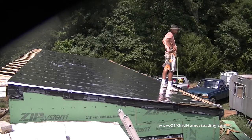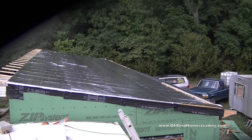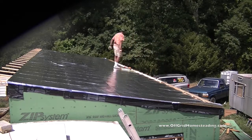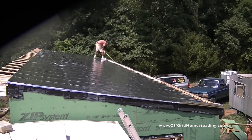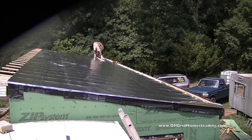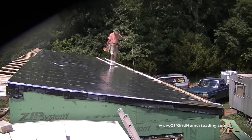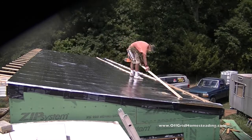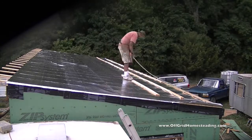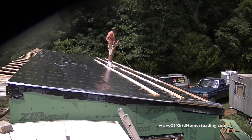These are 16-foot purlins — 1x3s — and the goal is to get them right to the edge of the decking so that when looking up at the exposed rafters you only see the rafter tail, giving that classic craftsman-style look. I went ahead and put two nails down, trying to land right over the joist for additional bite and rigidity. Each purlin was measured out at 24 inches on center. It started raining toward the end and that last section near the close end is actually about 28 inches rather than 24, so things didn't quite line up.